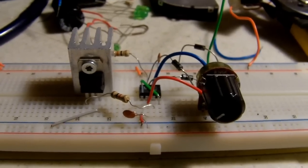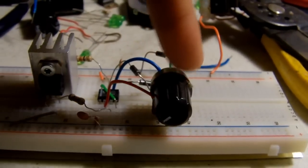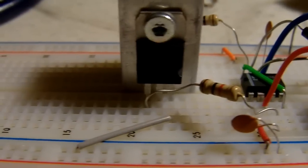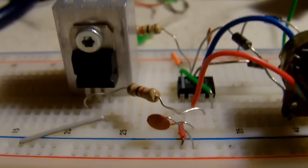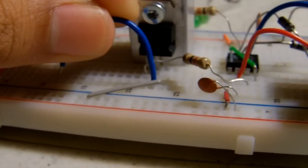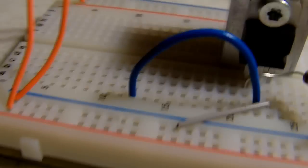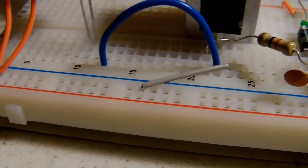Update: I changed out the ceramic pot for a taper pot. The second pin of our transistor will be our new ground — the pulse width modulated ground. Connect a jumper wire to a rail, connecting pin 2 to any unused rail. This whole rail is now our pulse width modulated ground.